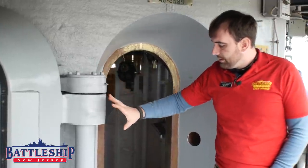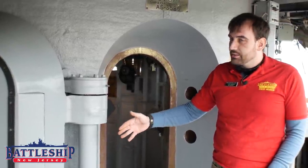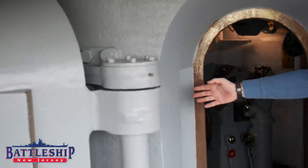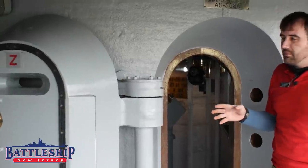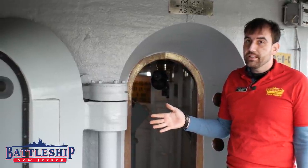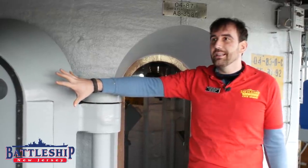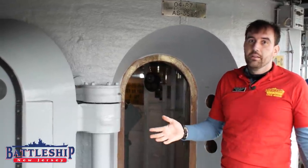This shaft here is what the electro-hydraulic motor acts on — that's the hinge for the door. You'll notice there's a section built out of the side of it, and a corresponding notch cut into the armor plate here. That's not cast in; somebody machined that out intentionally for the door to fit. Because this shaft is on the outside of the conning tower, even though the conning tower probably isn't going to be penetrated, it could be shot away. This will keep the door latched in place so that when this is shot away, it doesn't just fall out of the opening. Pretty smart idea.